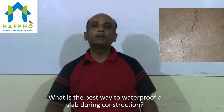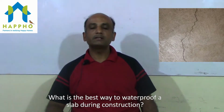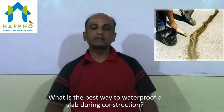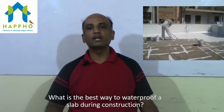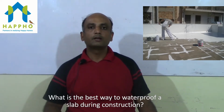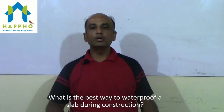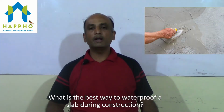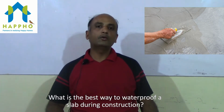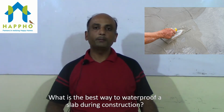The first step while building up the waterproofing layer is to identify the visible cracks, open up the cracks, and fill up those cracks with polymer modified mortar. The second step is to give the entire slab 2 coats of elastomeric waterproofing chemical. The waterproofing coat needs to be flexible as these slabs are subjected to deflections. These waterproofing coats are very thin, in the range of 1 to 2 mm. They require a protective screed of 12.5 mm to avoid any puncture to them.